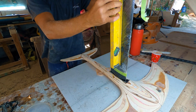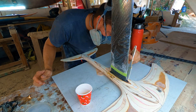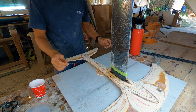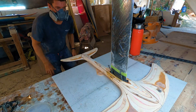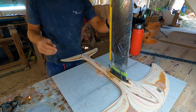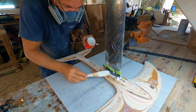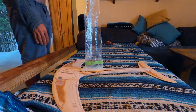Using a bubble level, I checked that the foil and mast were perfectly perpendicular and lined up. I continued pouring epoxy until the base hole was filled, and used screws to dial everything straight. Then I made a high-density filler joint all around the mast. Once cured, I removed the mast and was left with the perfect mast shape at the base.